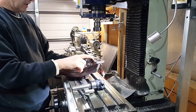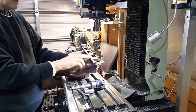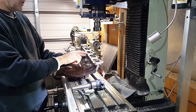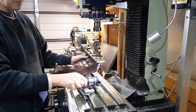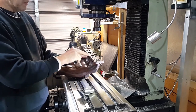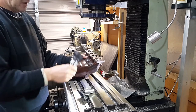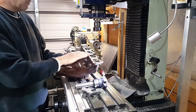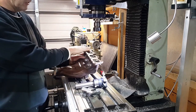Because there's quite a bit of a hump in here — there's probably about a mill and a half at least of warpage — we've got quite a bit of material to take off in the middle here. So we're going to use a face mill for that, just to get the worst of it off. And then we'll fly cut and do a skin pass just to finish it off and leave a good finish.